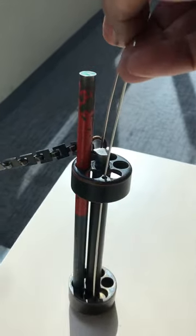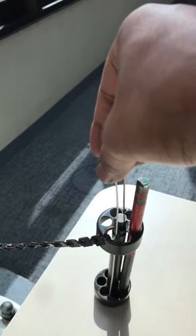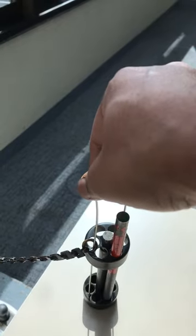You can see the red end of the magnet and the blue end of the magnet. The red and blue denote the north and south pole of the magnet. You can see how the magnets fit into the holes of the heeling error bucket. We normally start from the center and then place them diametrically opposite to one another around the center.